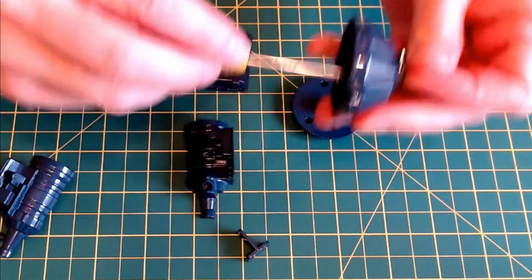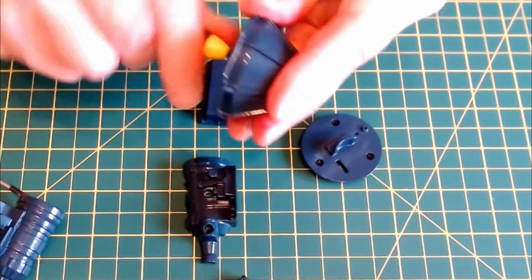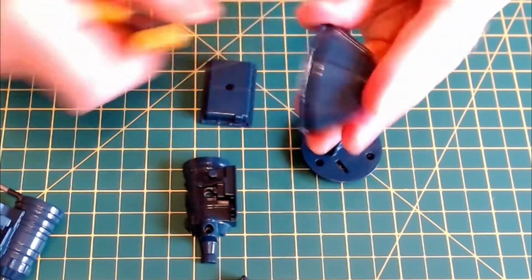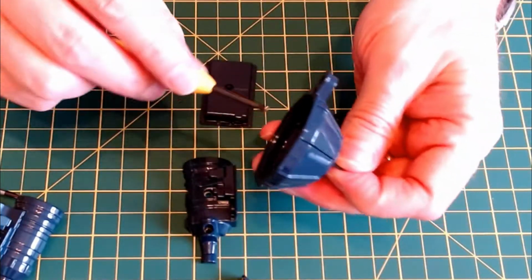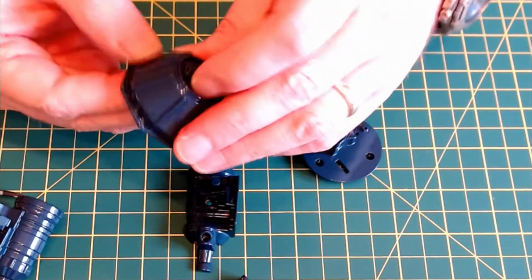DM screws, so going into metal, a bit fiddly. What is recommended is to take it out halfway and then back in all the way, then tighten it up so it's holding it. That seems to have worked quite well. Actually, that method of taking it halfway, reversing it, and then back in removes any of the cut swarf. Okay, first part done.